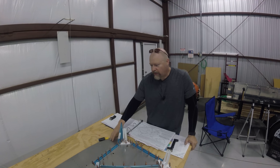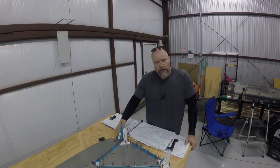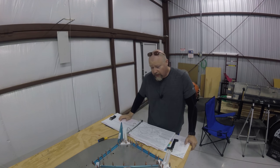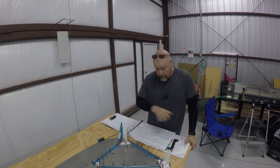I've got everything on this stainless steel and the aluminum. I've kept the bluing on the aluminum - I'll have to pull the bluing off. This is one of those areas where I am going to prime. I'm going to prime all of the aluminum because it's resting against the stainless steel. Stainless steel and aluminum can touch one another - their corrosion index is like nothing - but it's probably a better idea to go ahead and prime it. The white parts are powder coated so I don't have to prime those. I've got a lot of drilling and match drilling, and I have to go find all the nut plates that go on here.